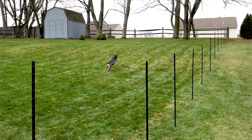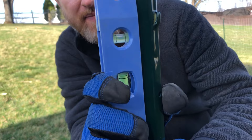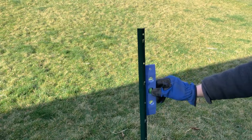Here are all of my posts spaced out six feet apart, and you'll notice that even though they're going up an incline grade, they're all perfectly straight up and down. If you have two people working together, one can hold the level and the other drives the post in. Even by yourself you can still do it — it's not perfect, but it works.